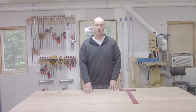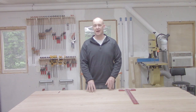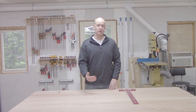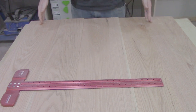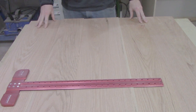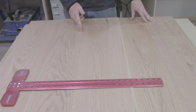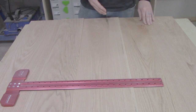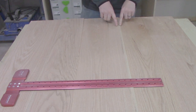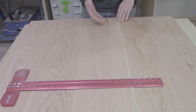Now, if you're trying to do something like I did here where I have three different widths of boards — and I did that on purpose to equal the distance that I wanted — when I glue them up they're in a certain pattern. Looking at my tabletop across the width, this tabletop is going to be 41 inches. Because I was able to get some different widths for the boards, I was able to make a pattern for this tabletop. You're not going to be able to see the lines where they glue up other than the fact that the grain is slightly different from one board to another. The goal when you're gluing up a tabletop is to make sure that your seams will pretty much be invisible. The only reason you'll know it's another board is just because the grain is different.